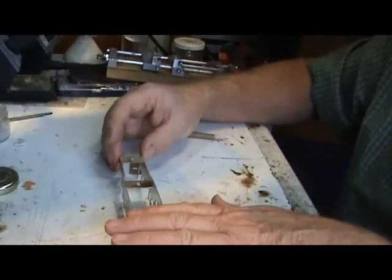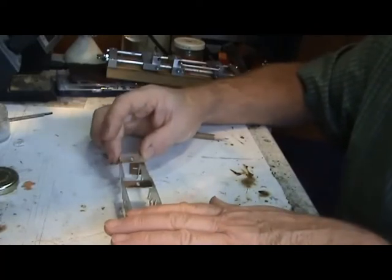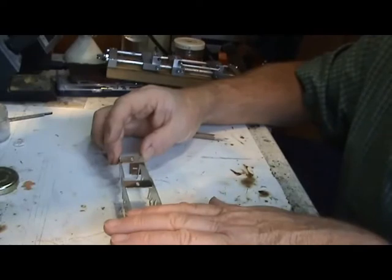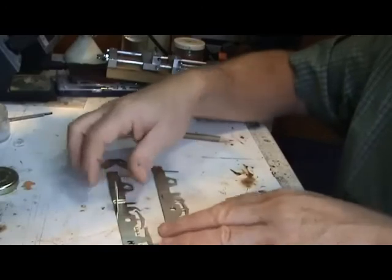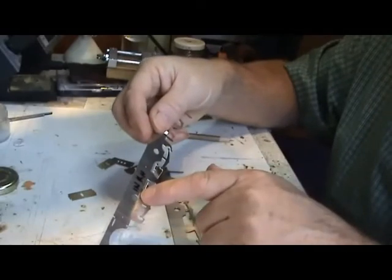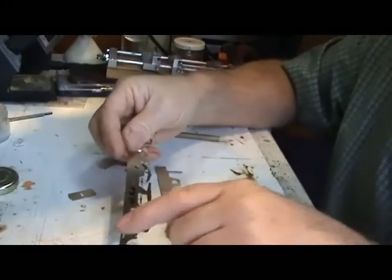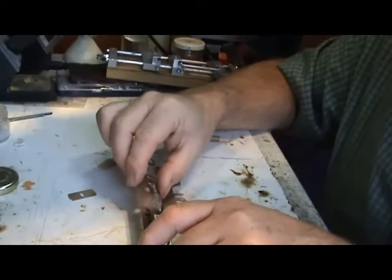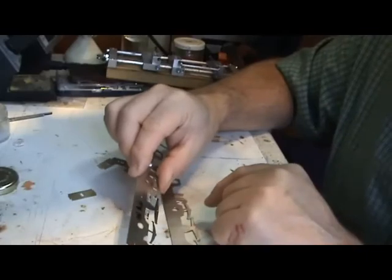I'll put two spacers attached to one chassis side and two spacers attached to the other side — this gives a nice fit when you eventually put them in the jig. I've also got to enlarge the holes here to take the bearings. Once I've got the bearings fitting snugly in these holes on both sides, I'll offer the whole lot up to the jig, and if it doesn't fit we can adjust the holes before soldering it up.